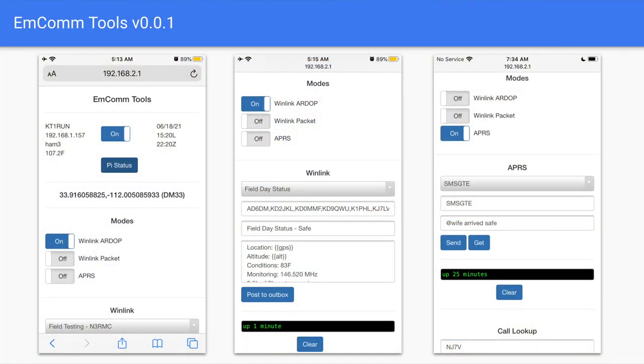Here's another good example. For APRS, if I want to send an SMS text message to my wife where I don't have cell coverage, I switch to APRS mode and for the 'to' field I select SMS-GATE from the drop-down. Then I put in the alias 'at wife' and my message. Now I've sent her a streamlined message through the cell infrastructure — going through another radio that got put on the internet — and she gets the text message delivered from the carrier. We have communication.